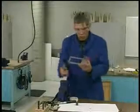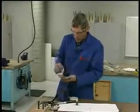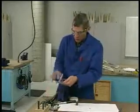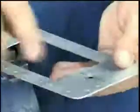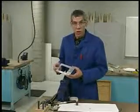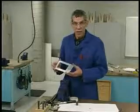If the rivets are sticking up a little bit, you can use the peening end of a ball peen hammer and put it on a bucking bar or something and just give it a light little tap, just to make sure there's nothing that sticks up when you rub your finger across. And that's all there is to installing the spring on your doubler for your access door panel.